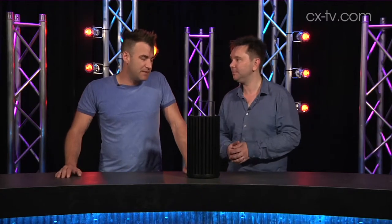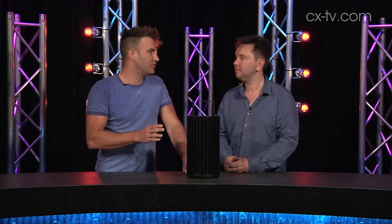People don't normally get that funky with house lights, so if you just want to keep it simple, stick to a lower control mode. The other nice thing is that you can specify what the unit will do when it loses DMX — it can either hold its current state, or it can go to a specified state.